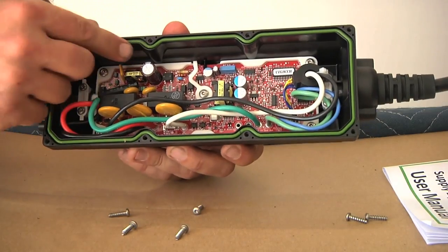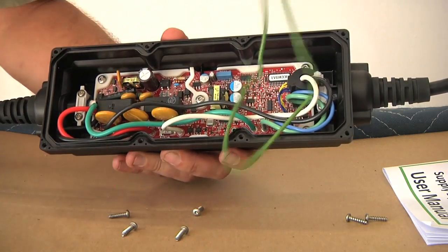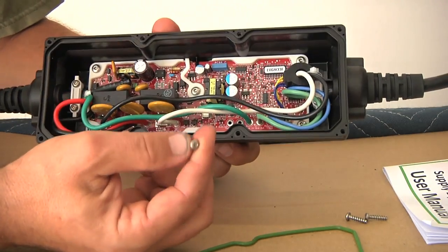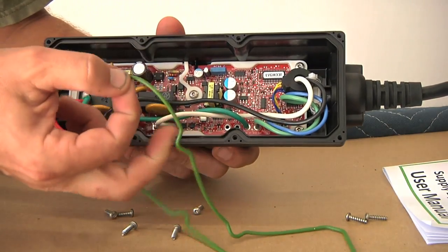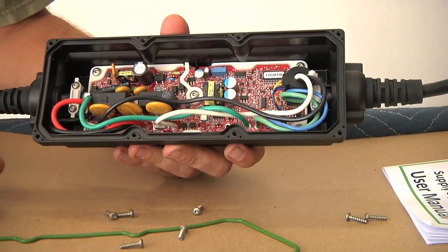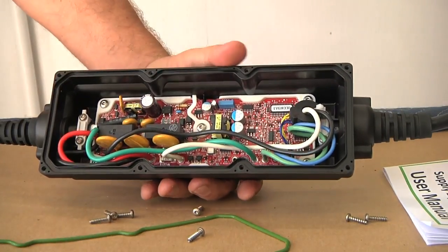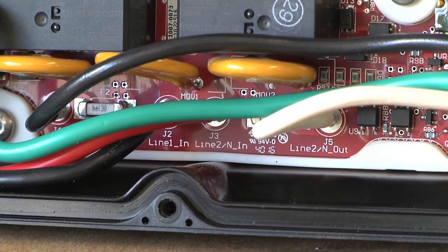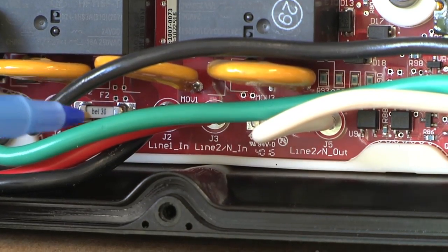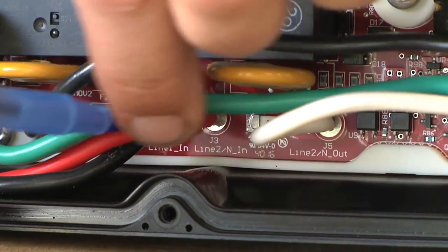There's a plain little gasket in here for waterproofing. I like that they use tamper resistant screws because a lot of times if they aren't used, manufacturers instead use glue — and if you take a box apart that way, you have to break it open and glue it back together. With this, I can just reassemble real easy. One other thing I'd like to point out: on this end, which is the wall power side, this is the power coming in from that 30 amp cord.